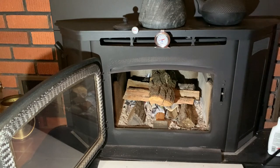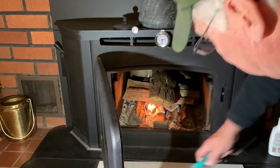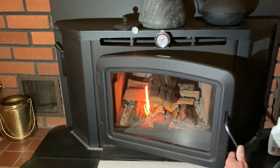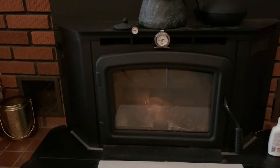The most important thing about starting this fire is to make sure you have your draft control all the way up. I've tried to start a fire a couple times with the draft control down — not going to get it to go. Once we get a little fire going, we're going to close it and push the latch down just a short way. Don't latch it tight or you're going to cut the air off. It's burning underneath and you really can't see the flames — you see the smoke rolling around. Sometimes you may have to open the door just a little bit to let more air in. Be careful if you open it — it's starving for air right now, that's why there's so much smoke. If you provide air all of a sudden, there's no telling where that fire is going to go. It may come back out towards you.